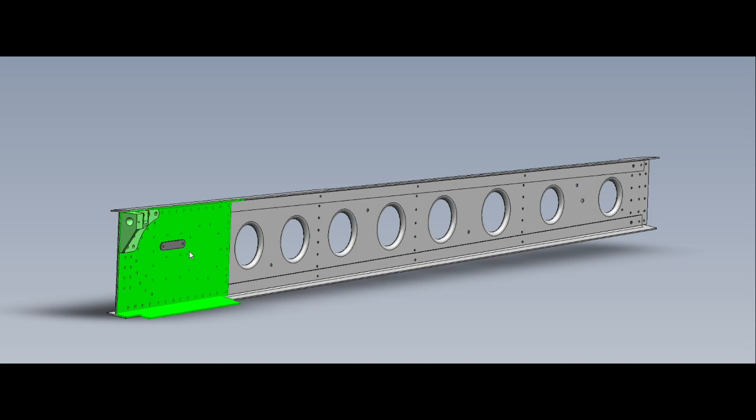All of these small faults discovered during the investigation were repaired. If you look at the modifications for the Hawker Typhoon, there are significant repairs in the back end, including reinforcing of the tailplane inner spar, additional quarter frames initially that led to full frames, and changes in rivet patterns. At one point they had a steel strap around the transport joint because it was known to be weak, and ultimately they ended up putting fish plates around the transport joint to carry loads between stringer sections across that joint. However, none of that solved the problem — aircraft still failed with the new fish plate modifications. It wasn't until a Typhoon pilot from a tail-fail aircraft survived that they got the last bits of evidence needed, and along with the resonance testing they proved there is a node on the tailplane causing flutter, which ultimately led to failure of the transport joint.